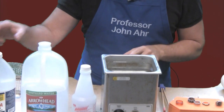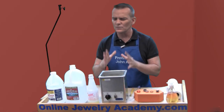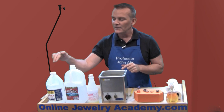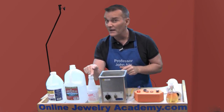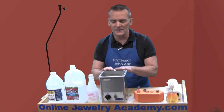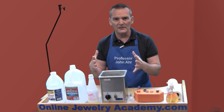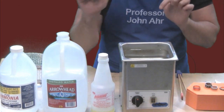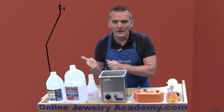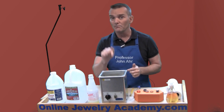You can add a little bit of ammonia or some other kind of degreaser if you want to, and this is really good for cleaning diamond jewelry. But here's the thing: if you do put either ammonia or a degreaser — which might also have ammonia in it — be sure to leave yourself a note on your machine that tells you that you've placed ammonia into the solution. You never want to clean anything that has ferrous metal in the ultrasonic with ammonia present, because ammonia will promote rust. So if your husband is working on the car and needs to clean a bolt, he could use your ultrasonic, but not if there's ammonia in there.